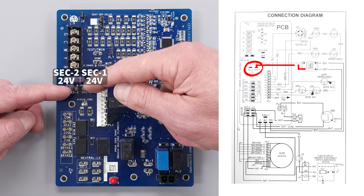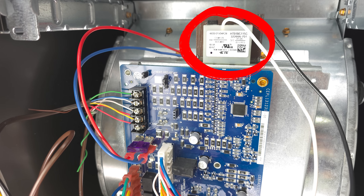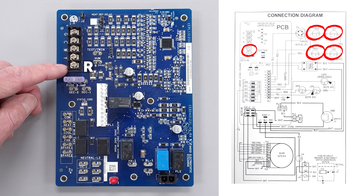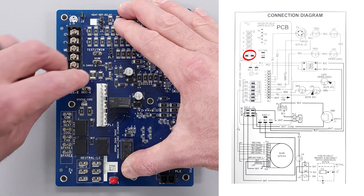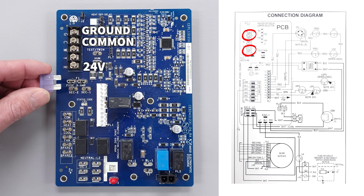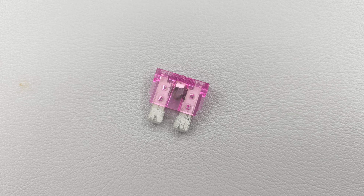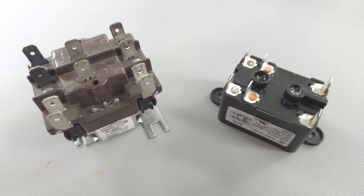It's a 120-volt to 24-volt transformer, and that transformer is going to supply 24-volt power over to SEC1 and SEC2 - that's secondary voltage. Before that power can go anywhere it has to go through this 3-amp fuse. The hot wire from the 24-volt transformer goes through this fuse over to R. It's going to protect the transformer from a direct short between 24-volt power and common, which would open up this fuse. It would also do this if there was too much power being drawn on the 24-volt components - say you added an extra transformer or extra components drawing excessive power, which may end up tripping that 3-amp fuse.